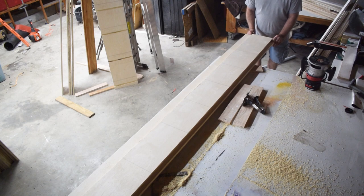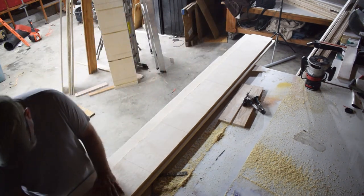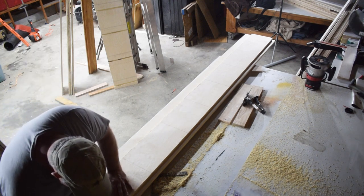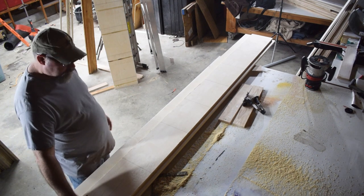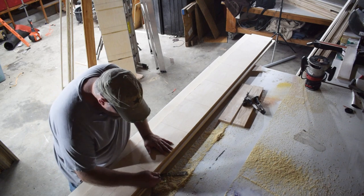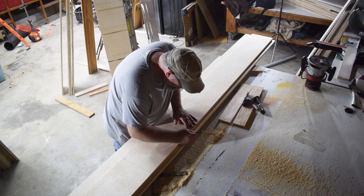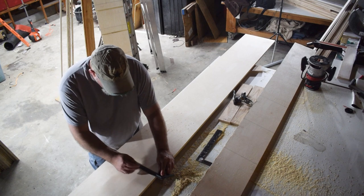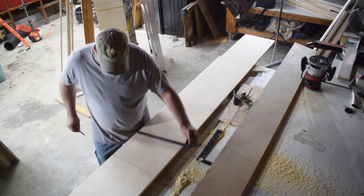Once I had the storyboard written up, I just lined up the same end every single time, made sure it was square and even, and transferred those marks to the boards I needed to cut the grooves in. So as long as I was careful, every single board had the same measurements and the same marks. After making the marks, I'd draw lines all the way across using the square so they're good and straight.